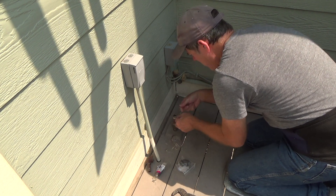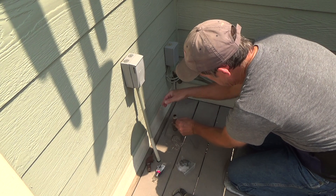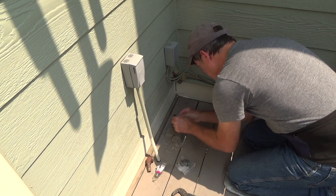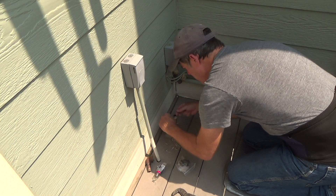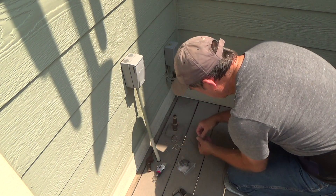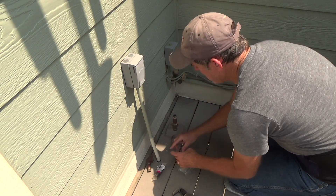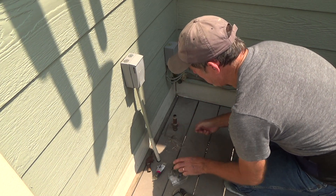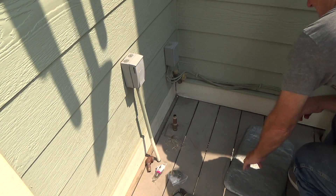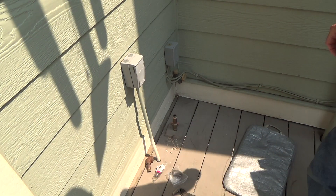So this Teflon tape could be 15 years old if they hooked this up from day one. See, lots of it is coming off below the threads — sometimes below where the threads are going to tighten. I'll just take off more. I'll spend a few minutes on that because I want it to look nice when I get done with it. Okay, once I put the new stuff on...